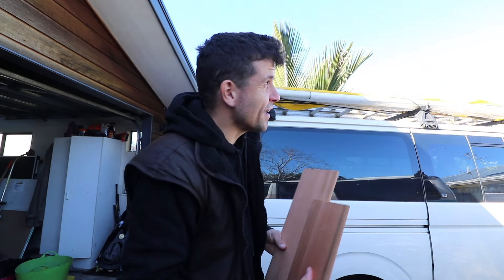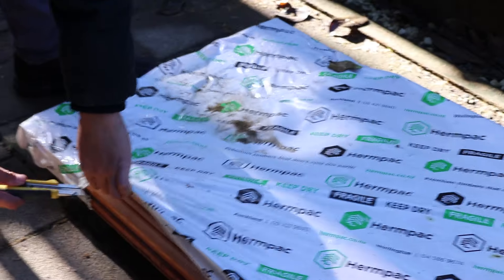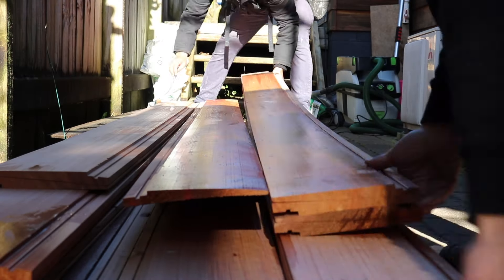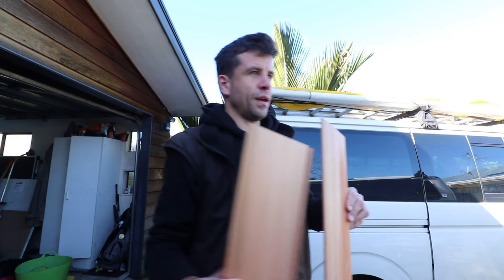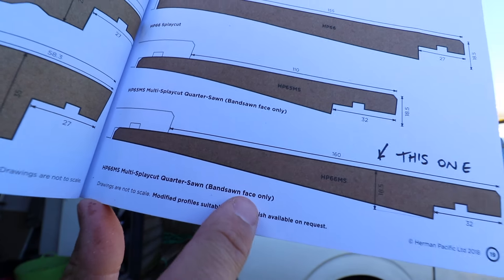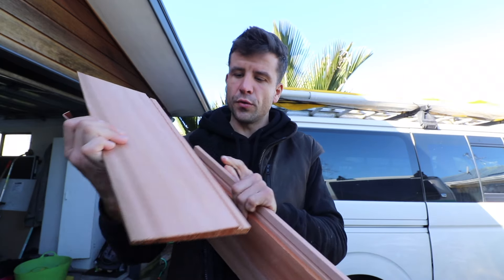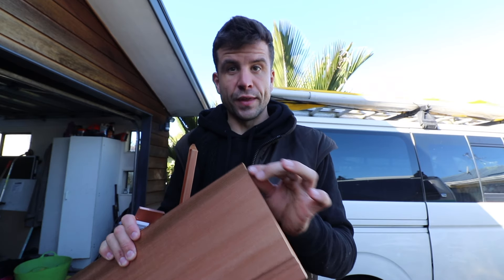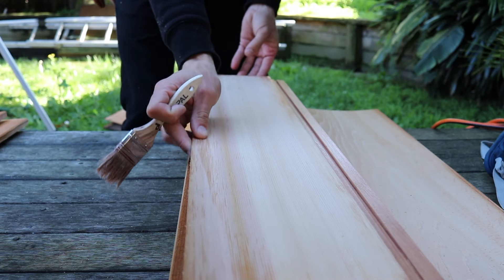In today's exciting video, the sun is back and we are doing cedar weatherboards. These particular weatherboards are multi-splay cut, quarter sawn, band sawn face only. Because they have rebates and they're overlapping, we have to oil the back, and as we cut the ends we oil the ends as well, so moisture doesn't seep in in areas where it may not dry out easily.